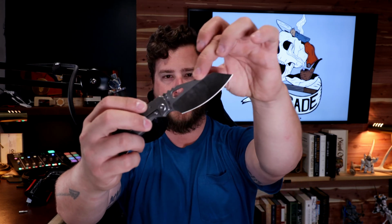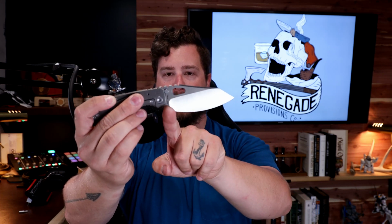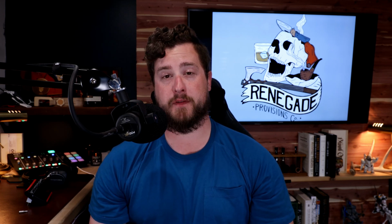And I don't happen to have an example of that sitting on my desk right now. But the chamfers were done very well. The backside, or the spine of the knife, was chamfered. So this chamfer line goes through the jimping and then through the scales and all the way around. The only areas that are not chamfered are the very forward part of this choil and up here at the tip of the knife.